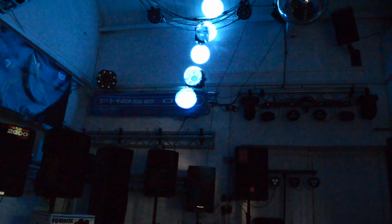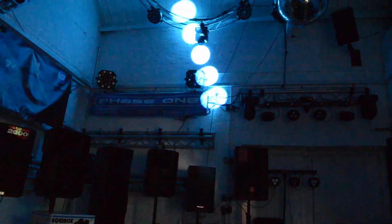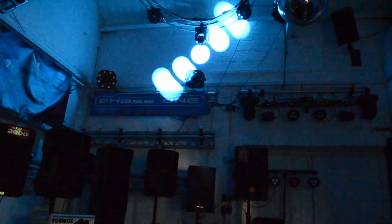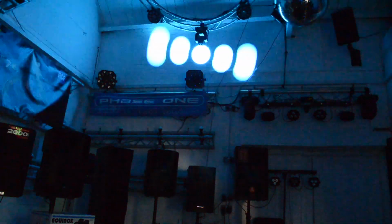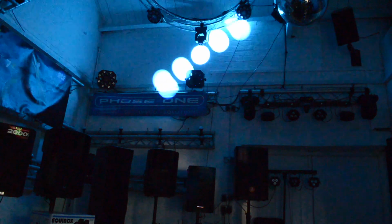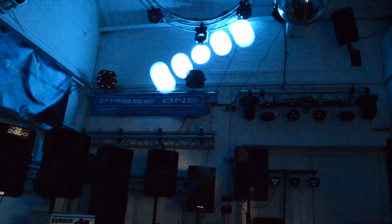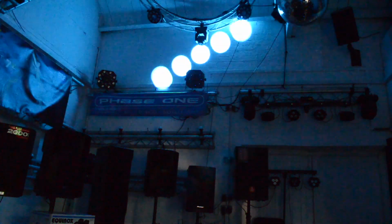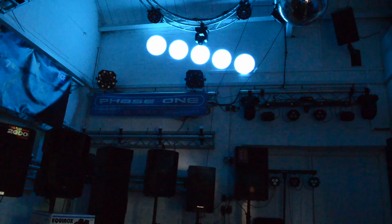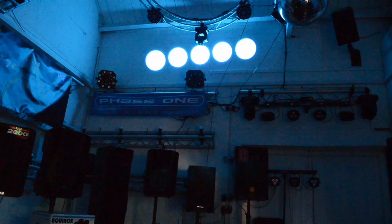And then eventually on this channel, this will turn into a gobo rotate and it will rotate that way, speed, and then go back the other way. So on that channel, which is channel 5 I'm using at the moment, that's your gobo rotation. And then right at the bottom of the channel we've got gobo indexing, so I can actually place that gobo exactly how I want it with some quite fine adjustment.